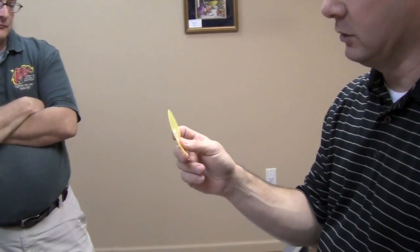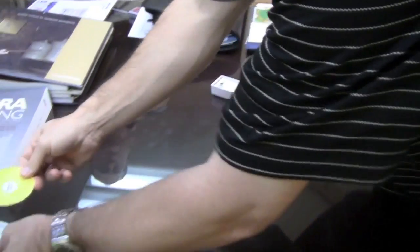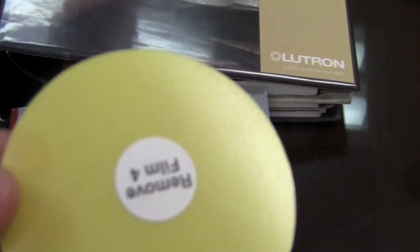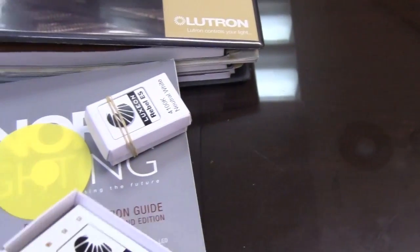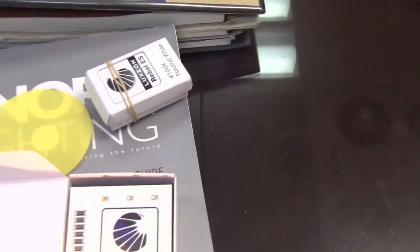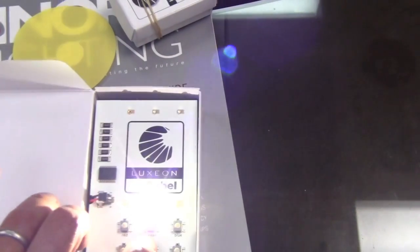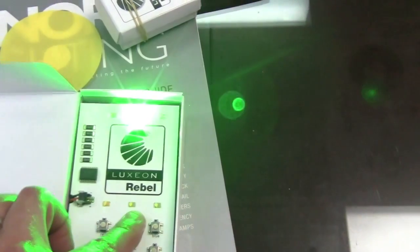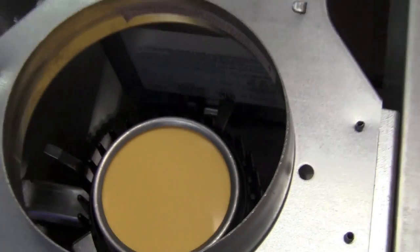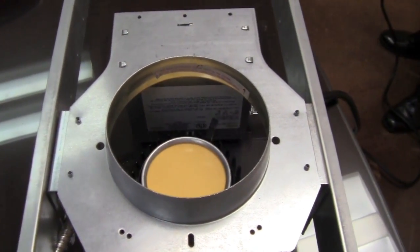Plus, this also has a material called meso-optic. Meso-optic is a holographic material. It was pioneered by Lidolite, which is a Philips company. And what we use meso-optic for, this luminaire here, is an architectural grade product. This is a 4-inch. This has 1,000 lumens out of the product. Wow. If you take a 26 watt lamp that's 1800 lumens, you get a 50% efficient optical system. You're getting 900 lumens delivered with 28 input watts. This is 27 input watts, and I'm getting 1,000 lumens.